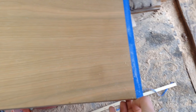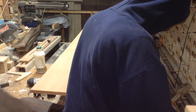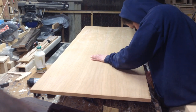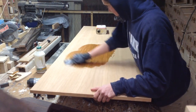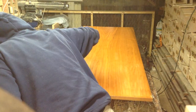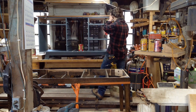I'm just rough cutting the cherry top down to size and then to width. This was a pretty big top — over 24 inches wide and about 5 feet long. I put a little bit of blue tape on before I cut it on my radial arm saw because this veneered ply has such thin veneer that the saw will tear it up. The blue tape kept that edge clean, so that was nice. Then I got some cherry veneer and I'm just veneering the edges. For the finish on the top, I'm using Waterlox because it's a pretty durable finish and I'm assuming there will be cocktails made on the top. The shelf life of Waterlox is not very long, so I would not recommend buying extra if you don't have plans to use it in the near future.